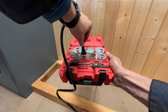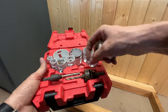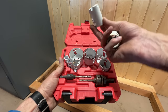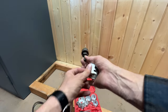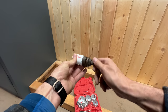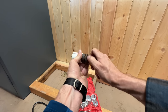This is the arbor for the small, little hole saws. The bigger ones have multiple holes in the bottom where these don't, or the holes are on the outside. So grab the one that's appropriate. How these work is you screw them in, not all the way. Do you see how the pins go down with this one? You have to line them up and get the closest one. So go in until it runs out of thread, then back it out until you line up and then run this guy in — and that locks it in.